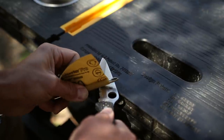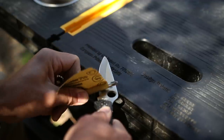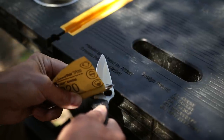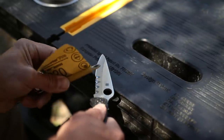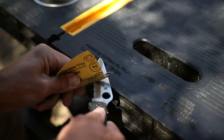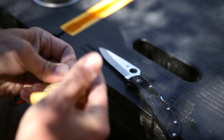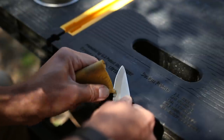You don't have to do this step nearly as long as the last step. What we're really doing here is polishing the bevel and making a really small burr — the same way we do when sharpening with our other stones, trying to polish the bevel, make that burr as tiny as possible and stand as tall as possible. It's the exact same method, only instead of going through different coarse stones, we're going through different coarse sandpaper. Using my smaller tool, I'm going to wrap the sandpaper around it as small as possible and get into those smaller serrations, matching that exact perfect angle of bevel.